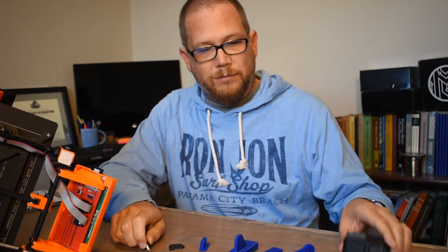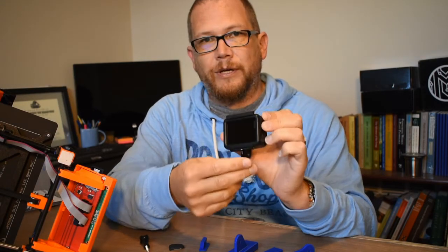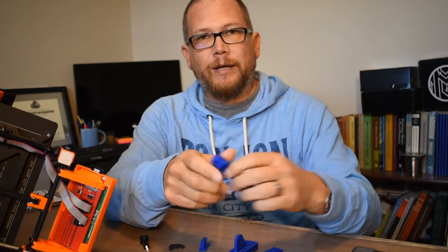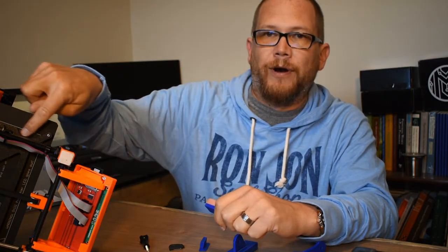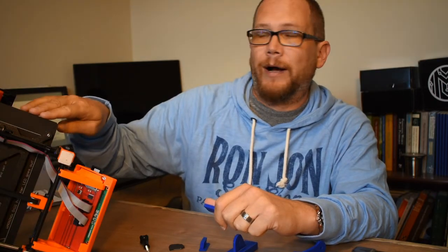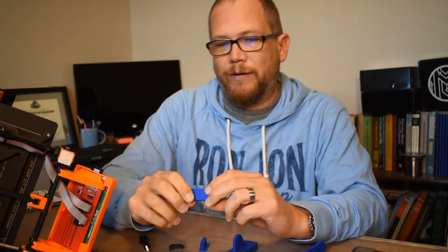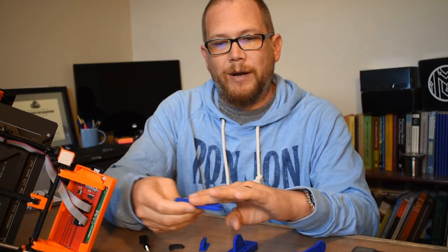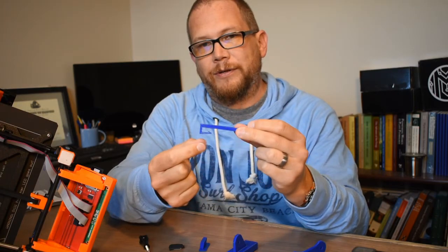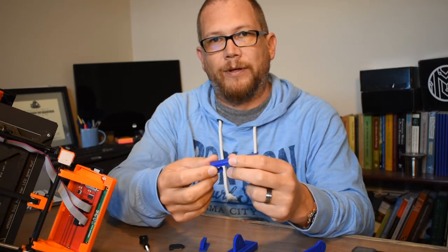So I took the GoPro — it has a frame with little tabs and ears, and there's a mount that comes with the GoPro that sticks in there. I made a mount, and the idea is that there's a frame underneath that holds the heated bed on. I thought it would be nice to attach the mount to that frame rather than directly to the bed. So basically this is a clip that goes underneath the heated bed and behind the frame. There's a bar under there, and this little notch with a clippy thing slides in and snaps onto the bar on the frame of the heated bed for the Prusa.